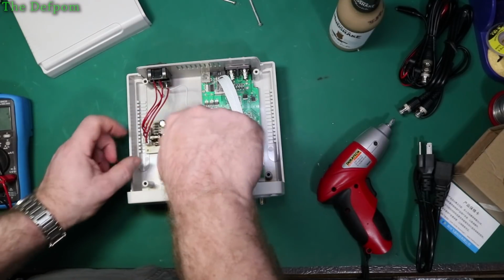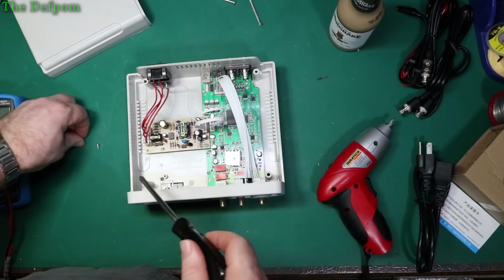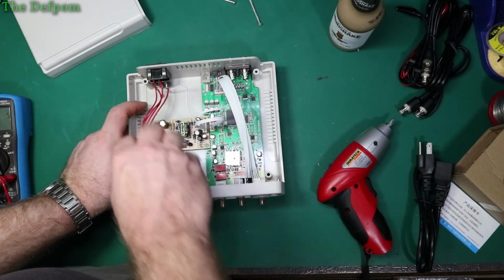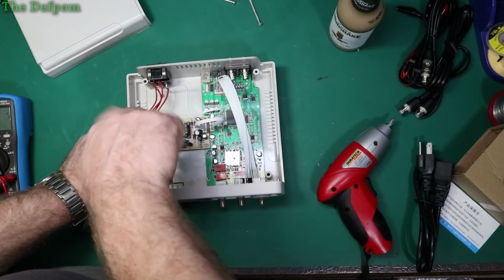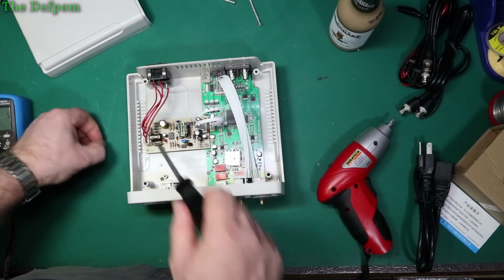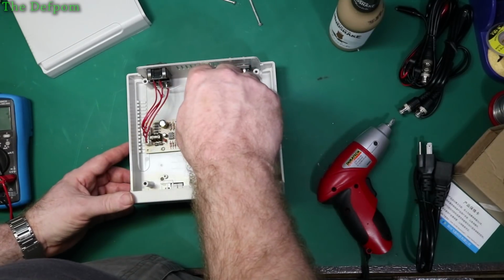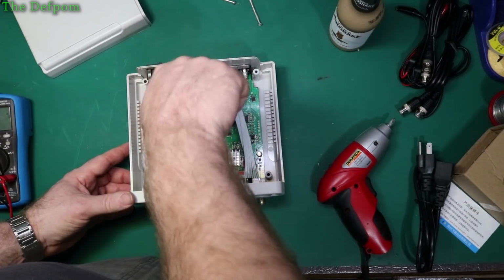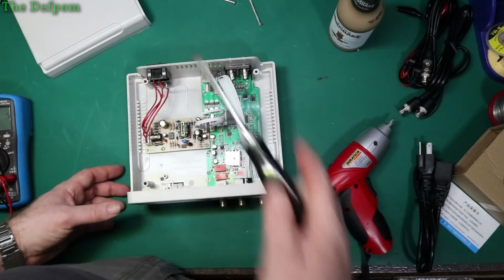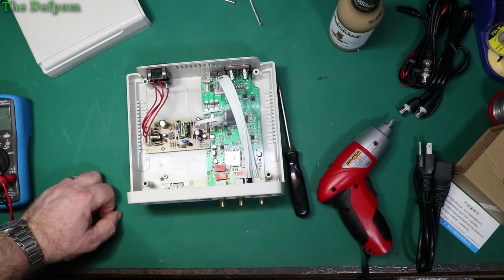That just feeds back what the output voltage is, and there's an isolation gap there between the traces, so yeah, I think it's okay. There's no input protection as such, there's no signs of MOVs or anything in there, but it's not likely to need it really. It's a nicety in this sort of gear. It's not like a multimeter where you need it on the input section to protect the input because you don't know what you're going to be getting on it. Whereas this is a fixed main supply coming in.